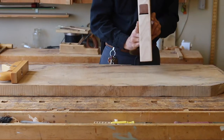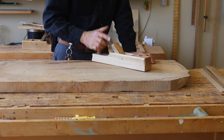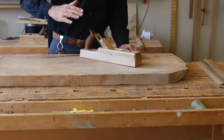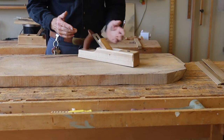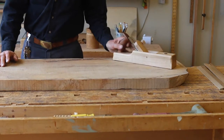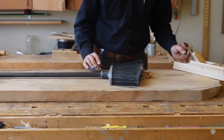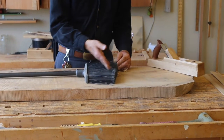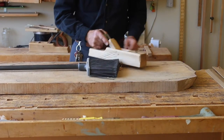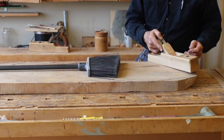The blade is set on a diagonal. Because the blade is curved, if you go starting here at the left and working back into the wood this way, you will always be shearing on a kind of downhill with the grain, with the waste already cleared away — so you get a much cleaner cut. It's a little hard to describe. Sometimes I've attempted to describe it using a broom: this represents the grain. When you're cutting here, you're cutting with these fibers, moving back this way — not going here and cutting into these fibers like this. You have to kind of try and visualize that.